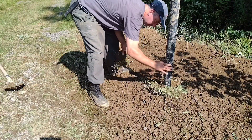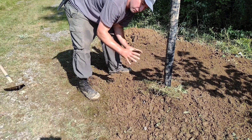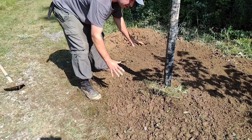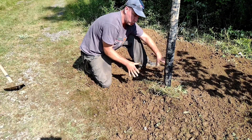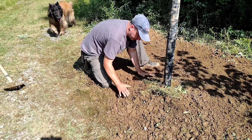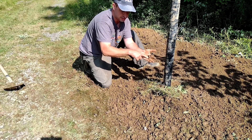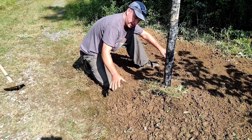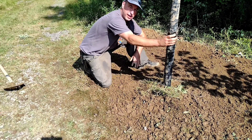I'm placing a little bit of sod at the base of the pole. You'll notice the ground comes up like a funnel — there are a couple of reasons for that. Over the next few days this is going to settle, so the extra dirt left there can be grabbed and put back in as the soil settles. The other reason is that you don't want water to pool around the base of your pole. I've sloped the grade so water will run off in every direction away from the pole, allowing this clay soil to harden. Clay when you squeeze it doesn't break apart — it's heavy clay — and once it dries and hardens it sheds water fairly well, keeping water from pooling around the post and keeping everything dry so it won't move.